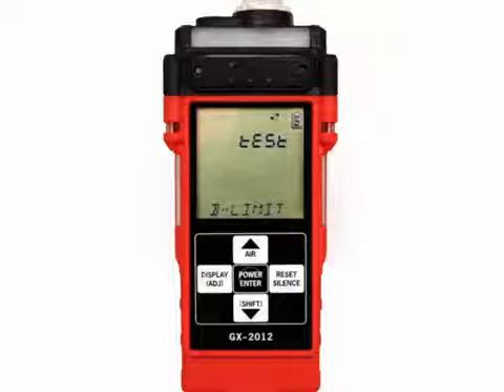If the bump reminder item in maintenance mode is turned on, the screen that appears next depends on how the bump expired item is set. If the unit is due for bump testing and bump expired is set to confirm to use, then the test and bump limit prompt will display and the alarm LEDs and buzzer will pulse several times. When this occurs, press and release the power reset silence button. You will hear a beep and the startup sequence will continue.